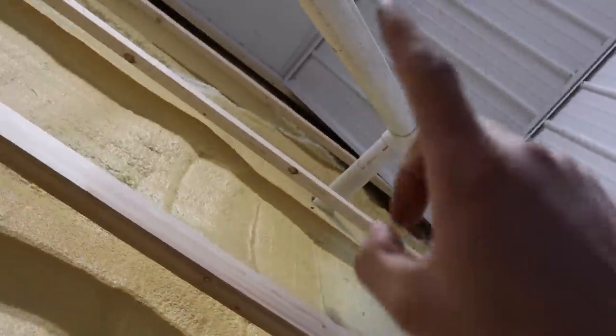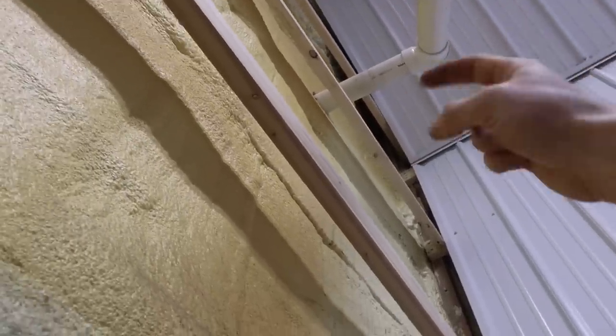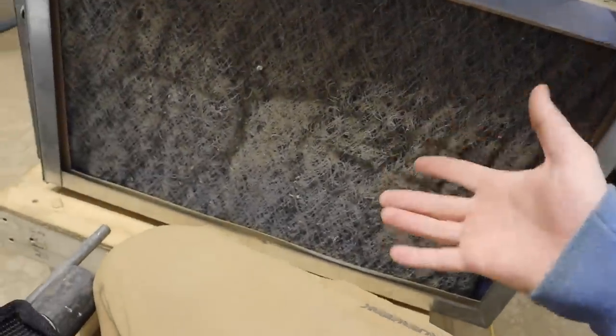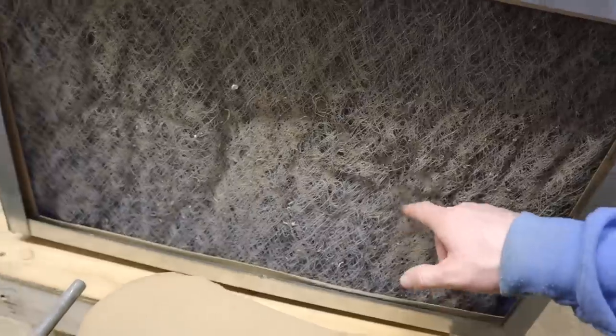It's actually going to work out pretty good. Our exhaust vent for the furnace right now — that's not going to be exhaust anymore, that's going to be the fresh air intake going up to the tube heater system. Reading the instructions, it says we don't have to use the fresh air intake, but it says if we're in a dusty environment it's recommended so we don't gunk up the inside of the motor. We haven't really done a whole lot of work in this shop and look how much gunk has built up on the filter — so once we start doing a lot of work in here, we're putting the fresh air intake in.